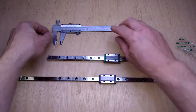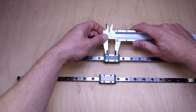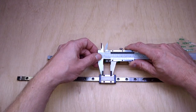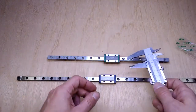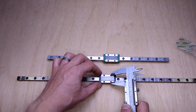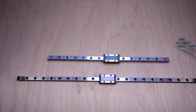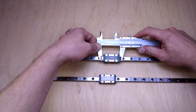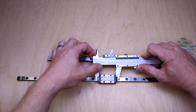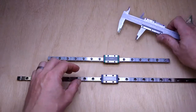In terms of dimensional similarities, the spacing on the centers — looking edge to edge — it appears to be the same. I haven't tried anything more accurate than eye measurement, but as you can see, the carriages look like they're meant to accept the same bolt spacing. And looking at the length of the carriage, they're designed to be the same — I think there's less than half a millimeter difference.